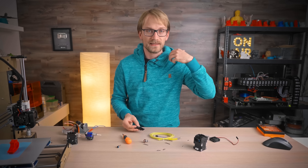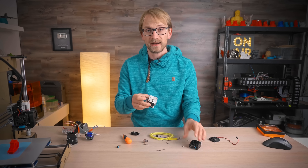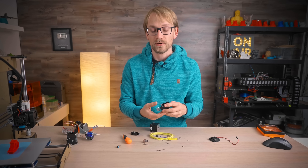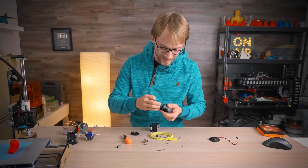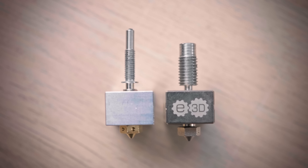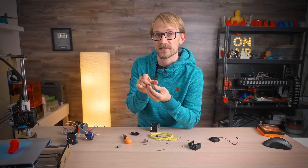And lastly, it's yet another proprietary set of parts for the extruder. There's no way around that if you want to advance performance — you need to cut some ties — but the entire stepper motor is now a proprietary part, as is the new heatbreak, which is another Hemera-only part. Let's see if this style gets adopted for more setups, because I really don't see any reason why the old V6 heatbreak would still need to exist. When it comes to thermals, the Hemera heatbreak should outperform the V6 one, since the heat needs to travel through less stainless steel outwards.